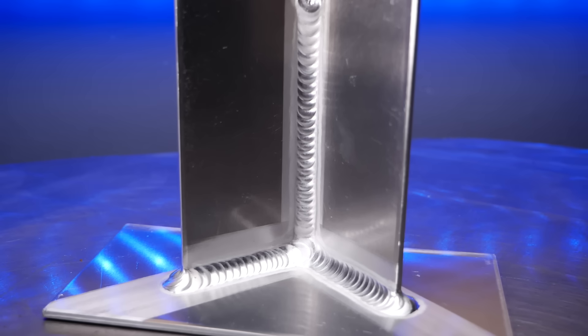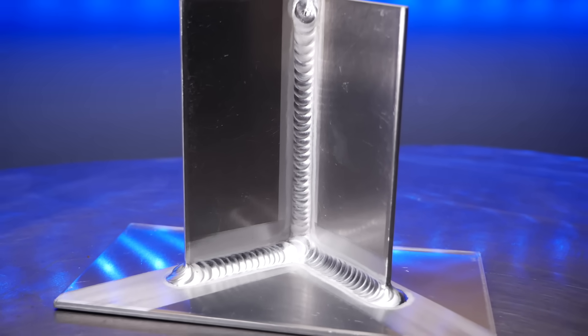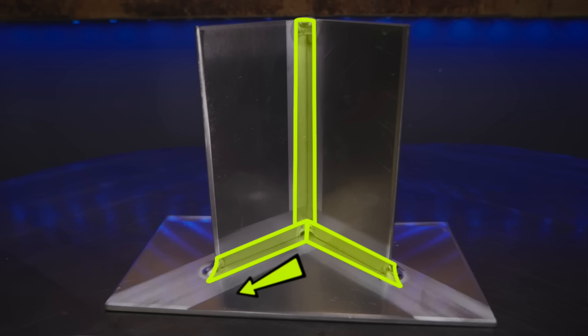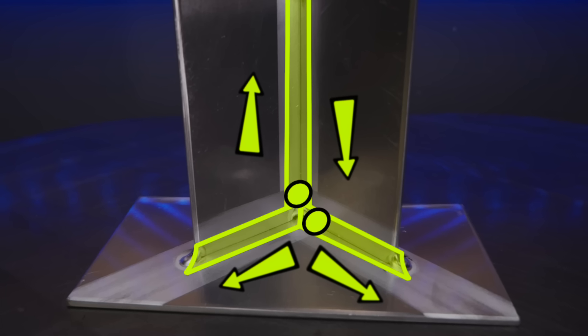There's an important detail problem that can happen with this one to do with welding directions. We want everything to look consistent, especially in an intersection where we have a few different welds flowing together. We don't want passes going random directions, and we don't want starts or buttons occurring in places that don't look good — this is going to mess up consistency with the flow of this joint. With everything I'm going to tell you, you're going to be able to make this one look amazing.